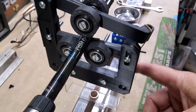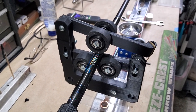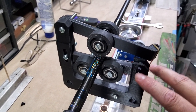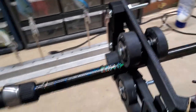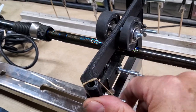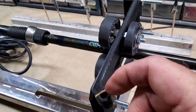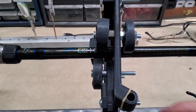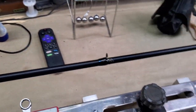The uprights I 3D printed — I found a file somewhere but ended up having to redo a few and remake them to my own design. Now they're fully adjustable in height to incorporate each rod. I've got thumb screws to tighten and loosen them. I made these little arms with bearings over top of the wheels. Right now I'm just using a little rubber band, though I might upgrade to little springs, but it actually works pretty good.